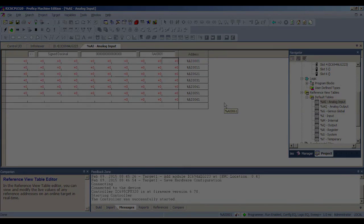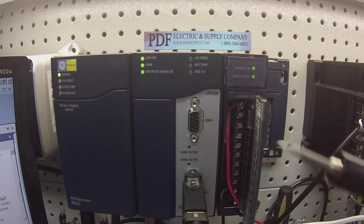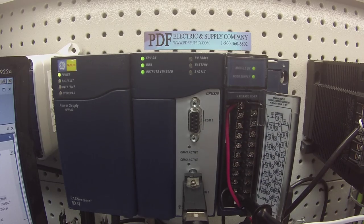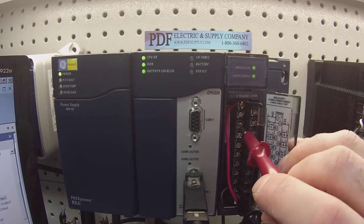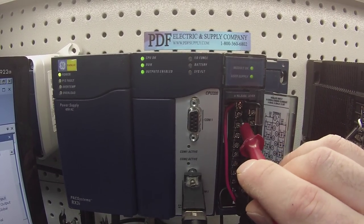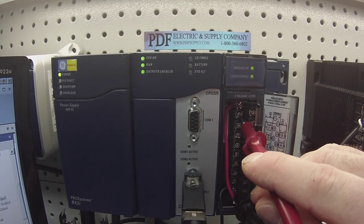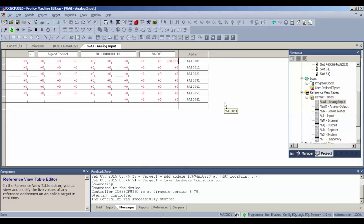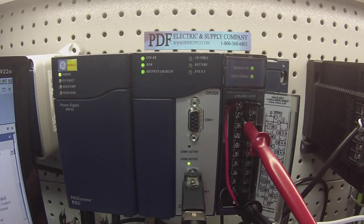All right. Now let's do a little demonstration of what you're going to see. My negative probe is going to go to the negative lead of the power supply. My positive probe is going to go to the first channel, which is terminal number 3. All right, and I have approximately full value. Full value is 32,000, give or take, depending on where I have the adjustment on my 4 to 20 milliamp output. Now I'm going to dial it down a little bit so you guys can see